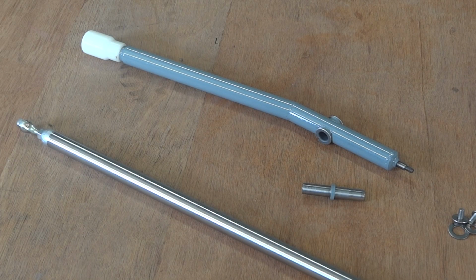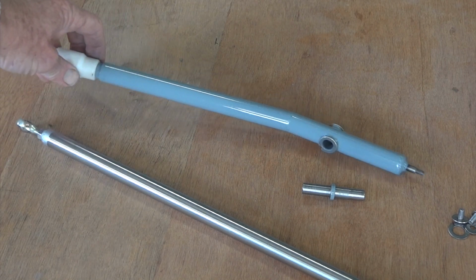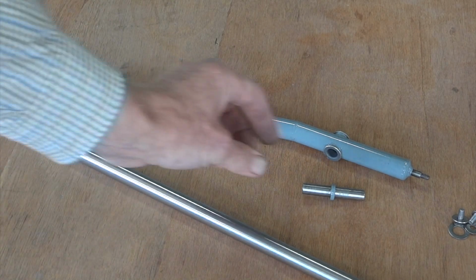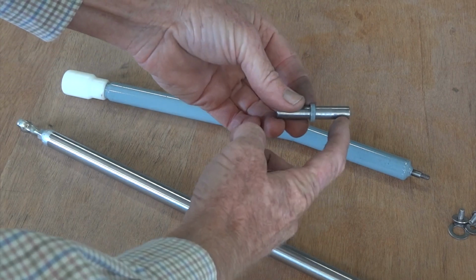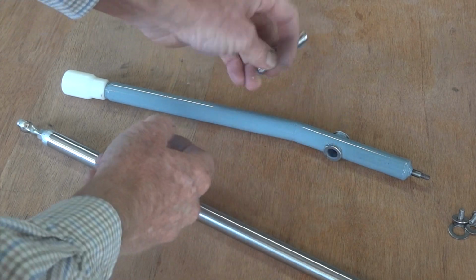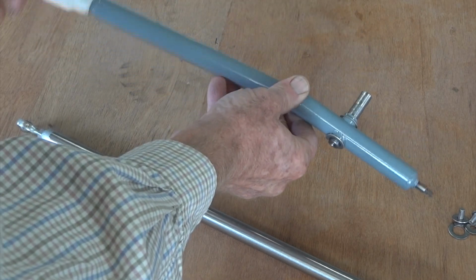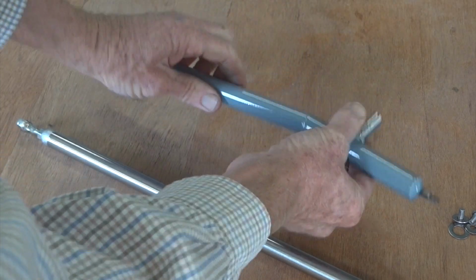Something new to the show is our little gear lever here. Now, because it's a sequential gearbox on a motorbike, it only has to move backwards and forwards, which makes it nice and simple. And that little machine plug, one end goes into a bush in the chassis, and the other end goes into two of those little DU bushes we've seen before, and that's nice.